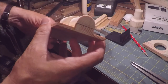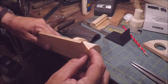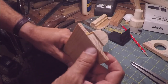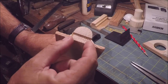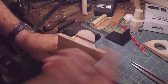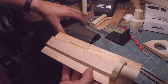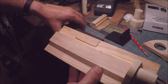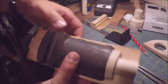I've glued my dowel onto here and had to adjust the height just a little bit - that's about two and a half popsicle sticks thickness. You should always have popsicle sticks in your shop; if you don't, you're really missing out on a great tool. Now you can see the profile that the core is going to be shaped like - it'll go up more or less straight with a little draft, then curve around. The thickness is all machining allowance so it'll all get machined off. I got a little carried away planing and made it too thin, so I had to glue another popsicle stick on there.